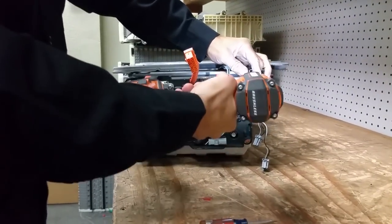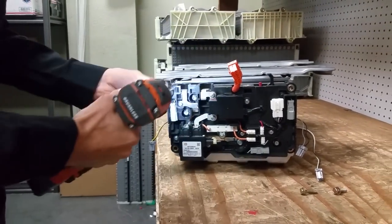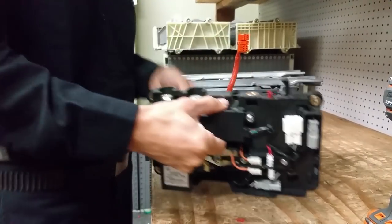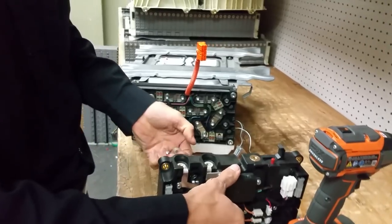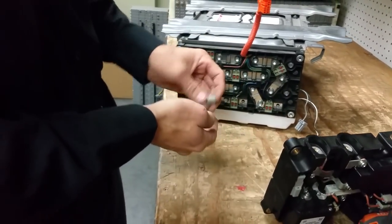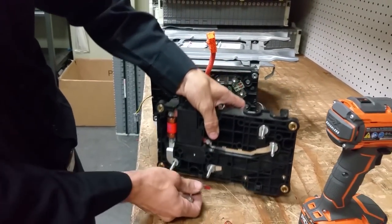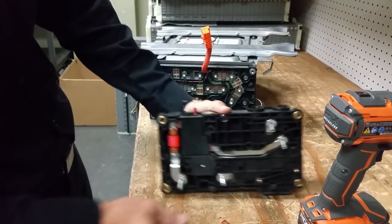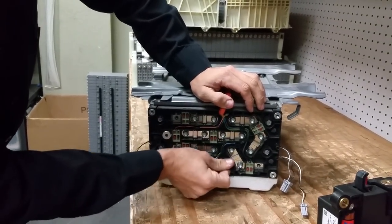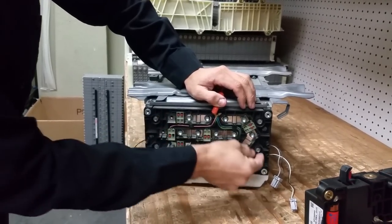Four bolts on the corners — lift this guy up and it comes out. When you open it up, you might find these four cylindrical washers on the inside. Where these four go is exactly where these four bolts came out of. They go on right there to fill the space and give it a good connection. You can find the matching counterparts on the other side — there's one here, two, three, and four. Pull those guys out and save them for later.